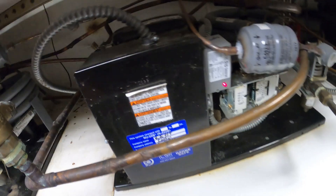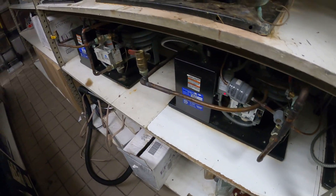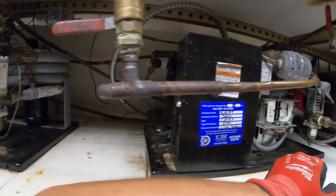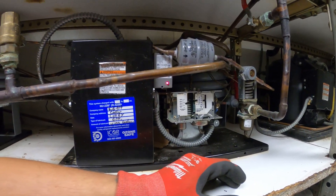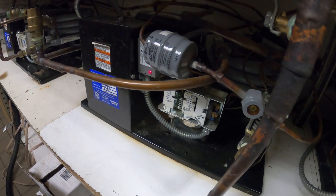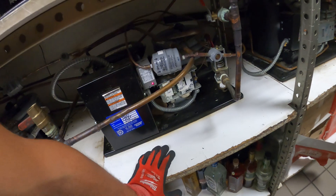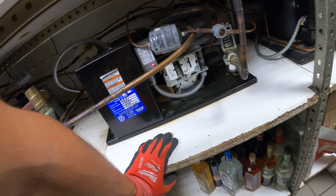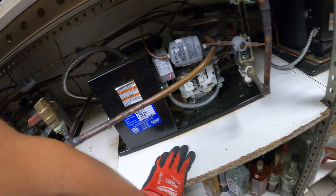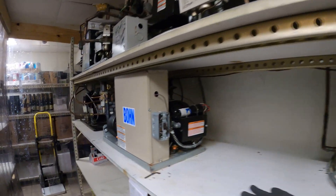I heard the compressor just start. From here, make sure we don't have any bubbles in the sight glass and make sure we get the temperatures and the box satisfies at the correct temperature. That's pretty much a service call. Typically, when a fan is not running, that portion of the coil freezes up. So that's how we replace that motor. The box was already cold — the only thing I really noticed was that the fan motor wasn't running, and that is what they called me for. They said how come one of the fans is not spinning, and that's because they had a bad fan motor. If anybody found this video interesting or helpful, please drop a like, comment, and subscribe — I'll catch you all next time.